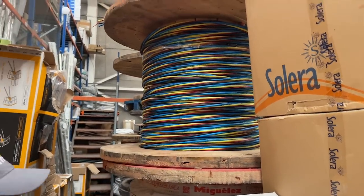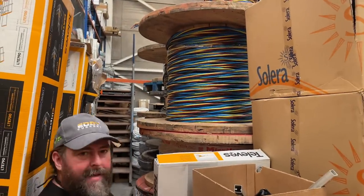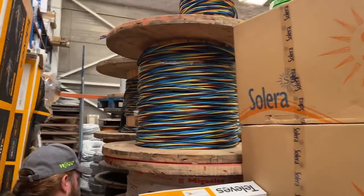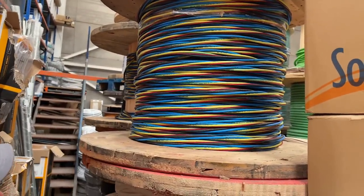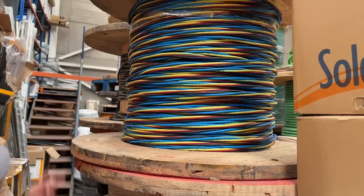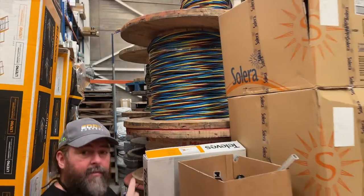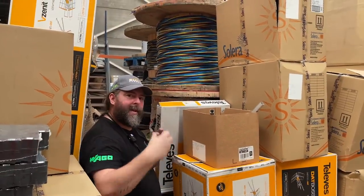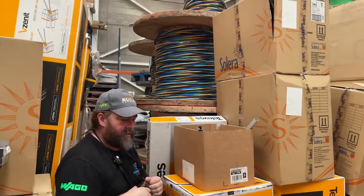So that cable is sort of pre-bundled if you were running from a meter to an apartment? Exactly. Conduit, exactly. This comes up to 35 mil, if I'm not mistaken, from 10 to 35 mil. Is it tough to pull, being halogen free? No, it's easier to run that in than single cable off a roll, because it's already twisted, so it's already less dimension. It's kept tight together.